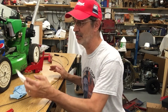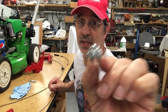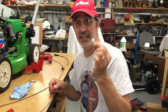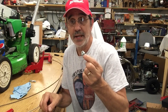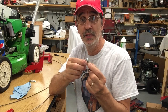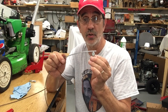You also need to buy these tiny little cable clamps. The smallest ones I found are for one-sixteenth inch cable, and yes, you are using one-eighth inch cable on your machine. Cable clamps are designed so you run the cable through, make a loop, come back through, and clamp — so a one-sixteenth cable clamp would have an eighth of an inch of cable in it once you make the loop. But for this repair we're just going to stick it in once and crimp it on the end.